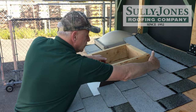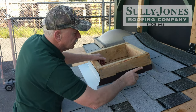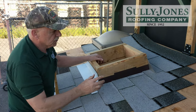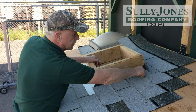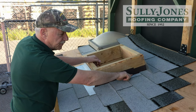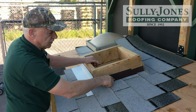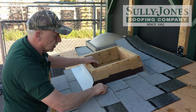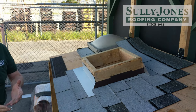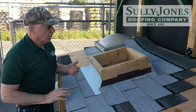Water comes down here, runs off, comes down — everything bypasses. The way a tin shingle run works: water comes from one shingle and it might blow in or slip onto the top of this tin shingle, it comes back out on this shingle, this tin shingle comes back out on this shingle, this tin shingle comes out here. It all keeps running downhill. If it's done right you don't have any problems with it.